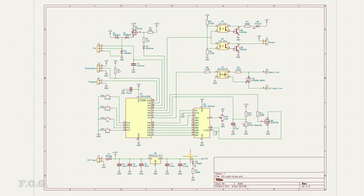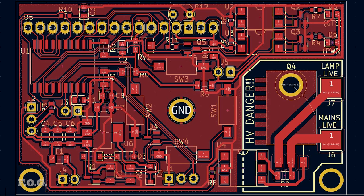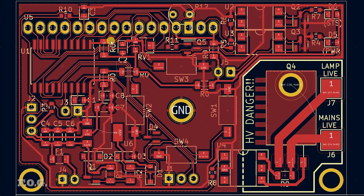Now let's look at the PCB layout. This is a single-sided board viewed from the copper side. There's really no downside to single-sided here—it's quicker and easier to make. Using a single 1206-size zero-ohm resistor I can jump over four signal traces, and for this board I only needed four of these zero-ohm resistors to make all the necessary jumps.